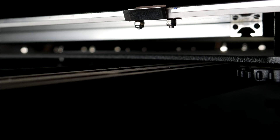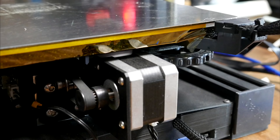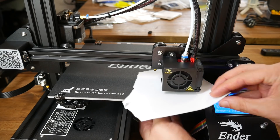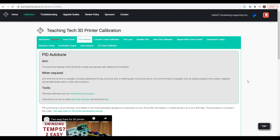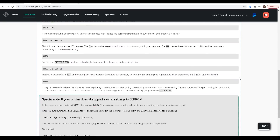If you're wondering about what thickness of foam to use, look underneath the bed — for both of these printers, 10mm foam was pretty ideal. Before you move on, unless you're using solid mounts, you will need to re-level your bed. And if your firmware was running PID for the bed, you should auto-tune it to suit the new insulation — I'll link to my page in the description to guide you through doing exactly that. As far as 3D printer mods go, this is about as easy as it gets.